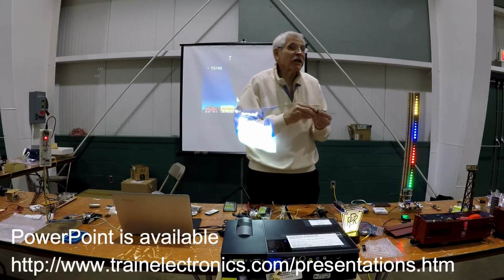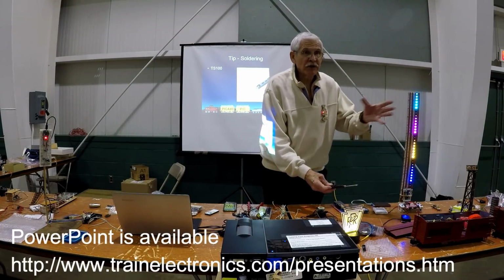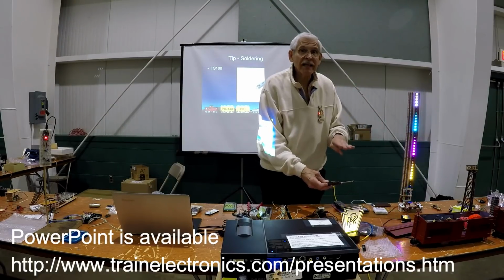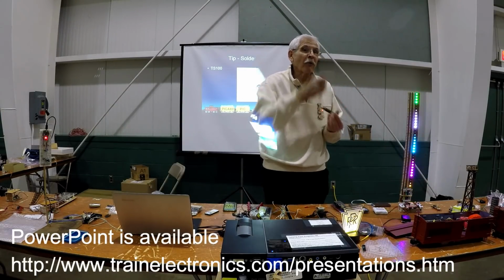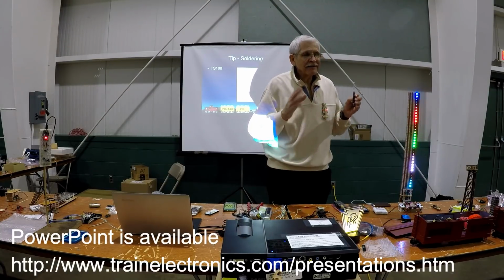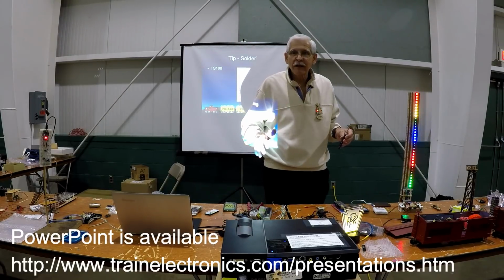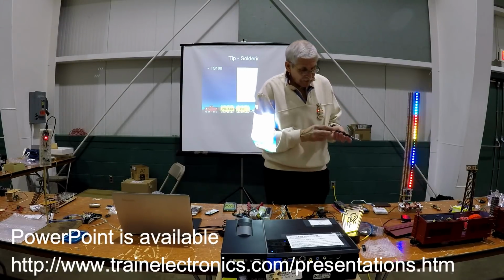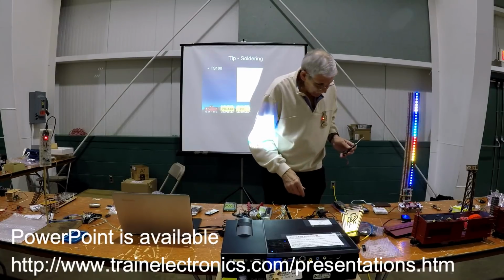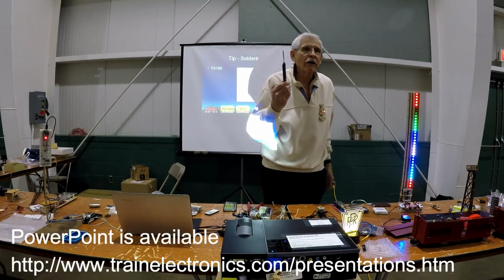First of all, it has an accelerometer. So if you put it down, in about a minute or a time you set, it'll cool down to a preset temperature. As soon as you pick it up, it'll start ramping back up to the other temperature. And if you let it sit for another time you choose, it'll shut off completely. Plus, you can just put a plug in here, and where are my batteries? I have 3 cell phone batteries I can use to power this for about half an hour.